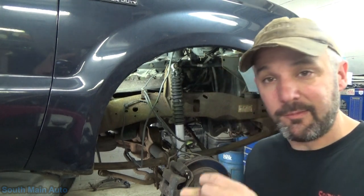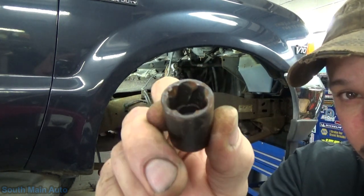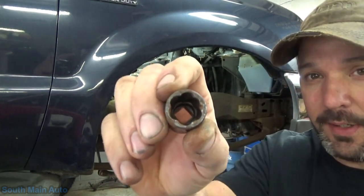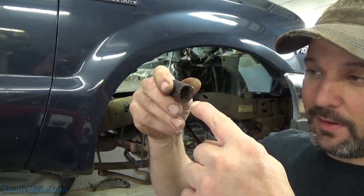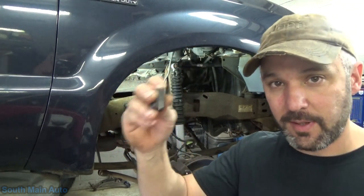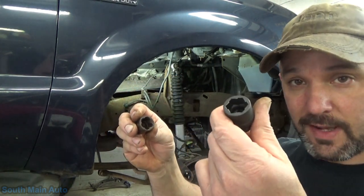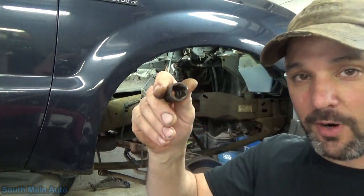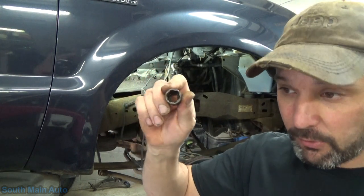This isn't your standard spiral cut extractor. Let me grab one of them so we can compare it. Mine's all rusty — everything gets rusty, even our tools get rusty. So here's our standard — I guess I would consider it like a spiral fluted external type extractor. The idea with these is they're kind of cone-shaped to a certain degree. Some vendors call these turbo sockets. They bite in the reverse motion, and the more you turn it, the more they drive on and the teeth bite in. I've got these in every size from about 4mm up to 24. Sometimes you put them on and they start to bite, but the teeth are so sharp they actually work almost like an end mill or an external drill bit — they'll actually start to shave the metal off as opposed to biting and digging in.